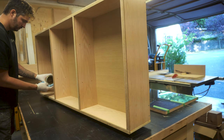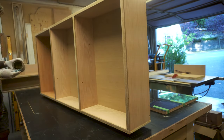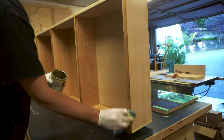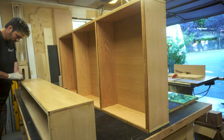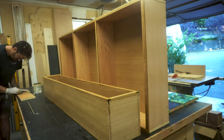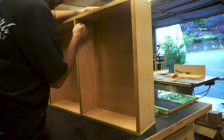For the finish of this cabinet, I'm using Osmo Oil Poly-X, which I'll link in the description down below. I applied the oil sparingly using a blue shop towel, and I let it sit for about 5 minutes. Once it had sat for about 5 minutes, I cleaned off any residue using a new blue shop towel. I repeated the step 3 times, allowing 8 hours to dry in between.